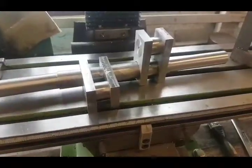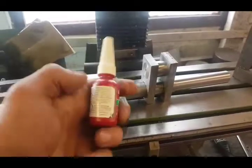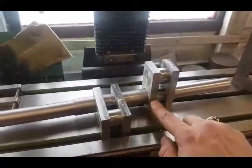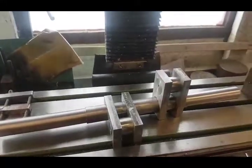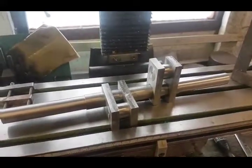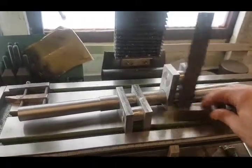This morning I just turned up the crank pins — I decided to turn them out of stainless steel because they seem to give a better finish than this EN8. I've used Loctite 638, and what I'm going to do is pin them in two directions: I'm going to drill in here and pin across, then also drill down from the top and pin with quarter inch steel. So with Loctite and that I can't really see it moving. I've lined everything up with a square edge and it's all looking pretty good so far.